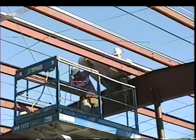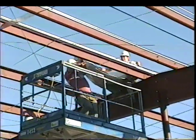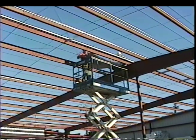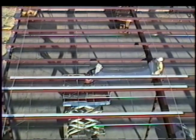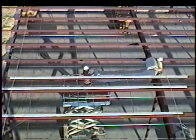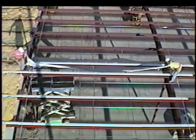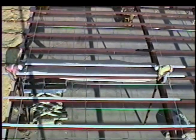Select the package with the specified piece of liner fabric, which will be marked to match the drawn layout, and remove packaging. Unroll the factory-folded liner fabric on the strap platform from one rafter to the other. Position the fabric between any two purlins, normally in the ridge space or at the eave. Be sure the correct color side will be down, since the fabric can be reversed and be different colors.